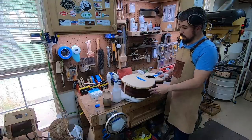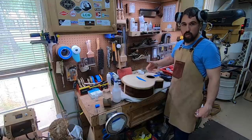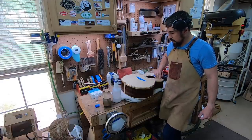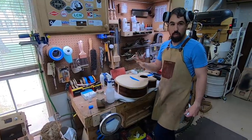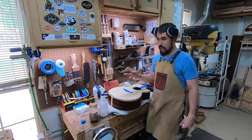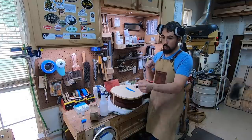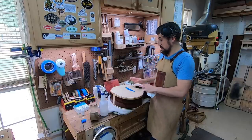The only thing that's different on the top is I want to get some good rags down inside the sound hole so I don't get water and soap dripping all over the label. I do not remove my tape until after I've buffed out the guitar because I want to keep everything sealed from the moisture. The top of the guitar on lighter colored woods like spruces tends to hide scratches more — dark wood will show you every little scratch. So you want to take your time on the top, even though you might think you're further along than you are, because when you go to buff it out you'll find little micro scratches.